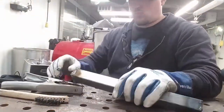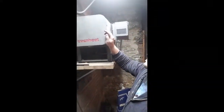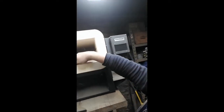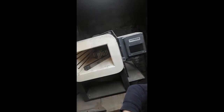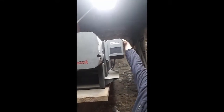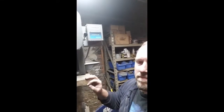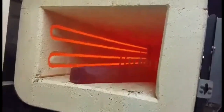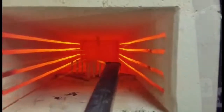At 1,600 degrees, this process is going to take about 12 hours, so you need something that you can keep hot for about 12 hours. This is my heat treating oven, and it'll do the job just fine. A pottery kiln will work equally fine. If you're working with an open fire, it's going to be a very difficult daylong process to keep your fire hot enough that your carbon migration doesn't stop.